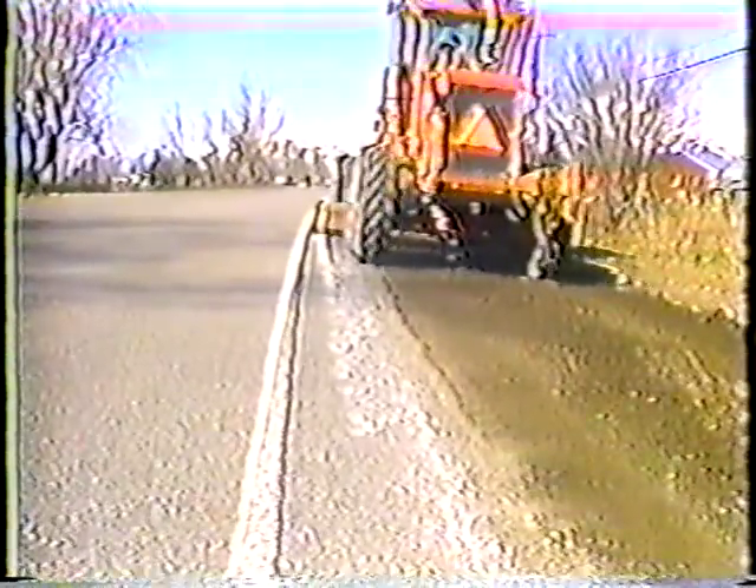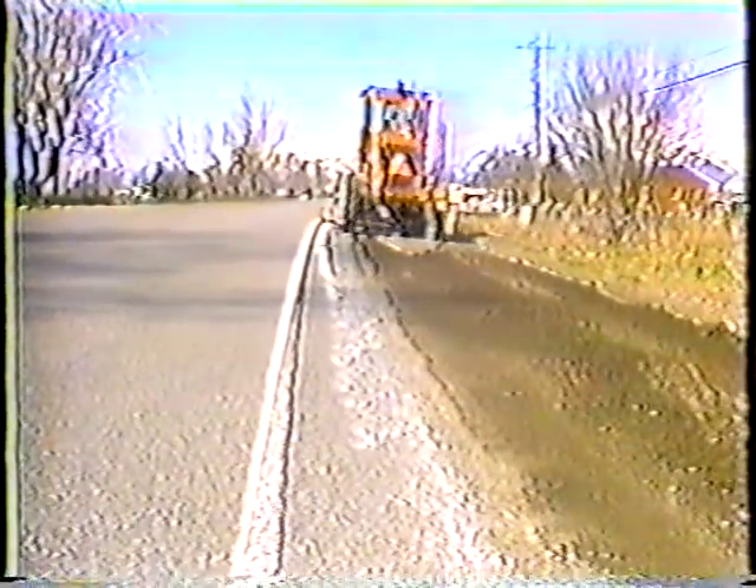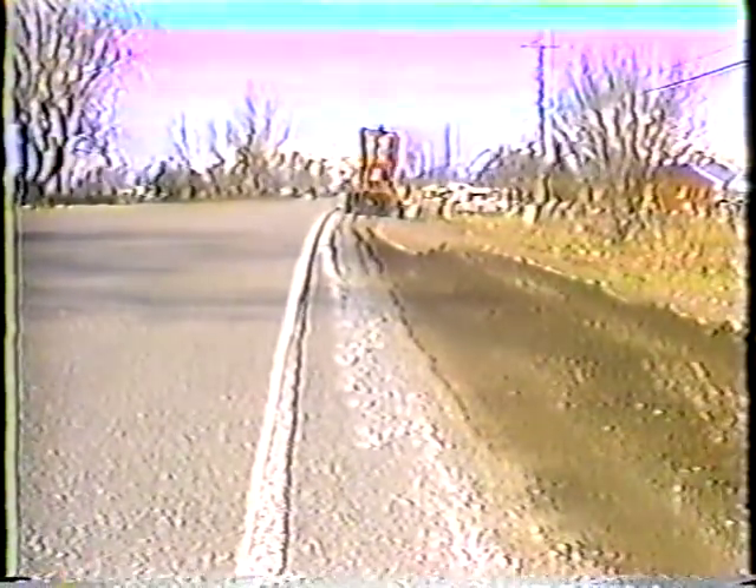That way, when you spread material back across the shoulder, the wheels can follow right at the edge so you can compact the material as you go. Remember, firmly compacting the material is one of the most critical elements of repairing the shoulder. And that brings us to the end of the program. As I said in the beginning, maintaining proper drainage can give our roads a longer and more useful life.